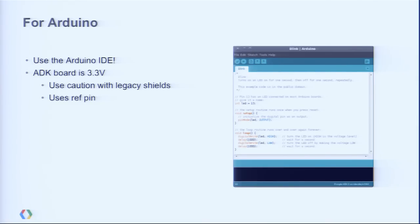So if you don't want to use it as an alarm clock, you can actually take it apart and pull the entire board off of it, and it's an Arduino, except it's 32-bit. So instead of writing code for a processor running at 16 megahertz, you can take that same code and run it at 84 megahertz.